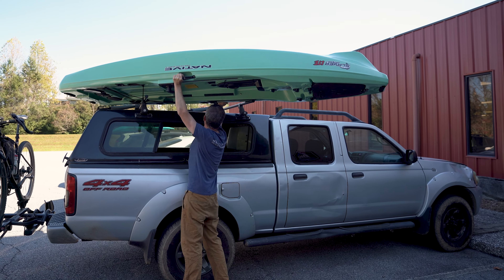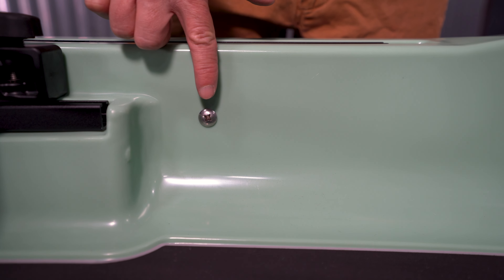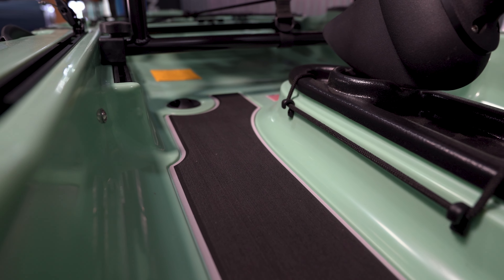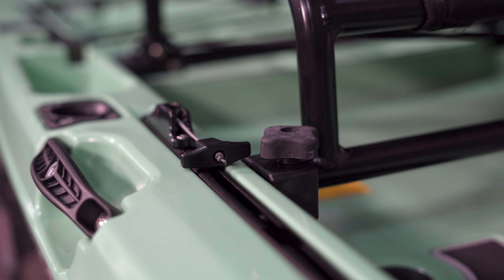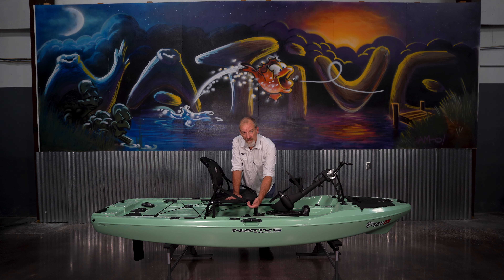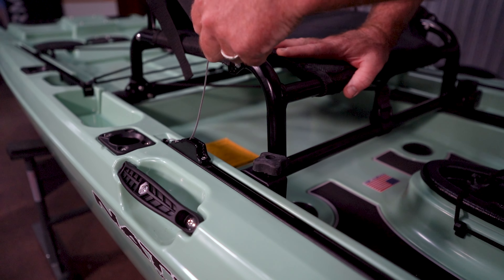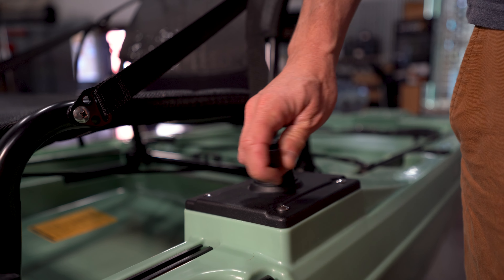Those double handles make it super easy to manage. As we look into the cockpit, you can see on the side walls we've got two screws on either side and those allow you to mount foot steering controls. So if you were to mount a motor, you can actually steer the motor with your feet. Moving back, you can see foot pads — they're not just for padding your feet, they also quiet the boat, so if you're standing or you drop something on the floor it helps keep it quiet. You'll also see the uphaul downhaul line for the rudder — you pull that, drop it into the jam cleat to hold your rudder up, or lift it to drop your rudder down. And then on the other side of the seat is the steering handle for the rudder so you can go where you want to.